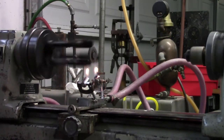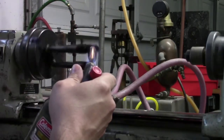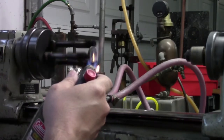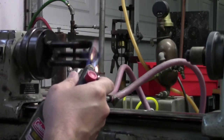Get our spin going again here and bring the speed down. I don't like running the lathe at high speeds for long periods of time — it really does wear out the spline shaft and the timing chains. They don't like high speed. You only want to run the speed you need during the sealing operation itself, because that's pretty quick.